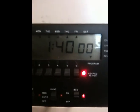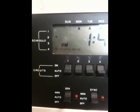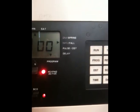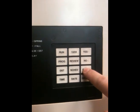Now Monday through Friday will flash once you hit yes. We can now set the schedule — we're going to be setting today's bell for the fourth schedule, and hit yes. These switches along the bottom I'll just set where somebody marked it in pencil. We're going to set this to a pulse and the default is three seconds, so we'll hit yes. Once everything is flashing, hit enter and you've successfully configured an alarm.